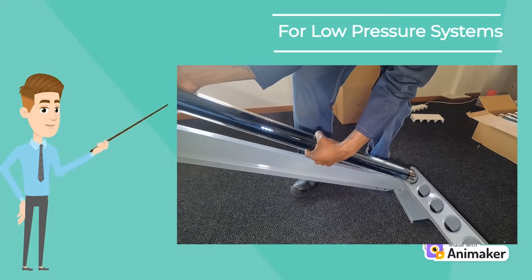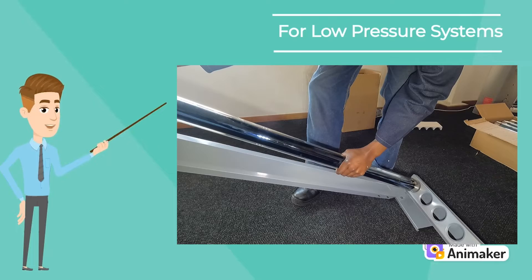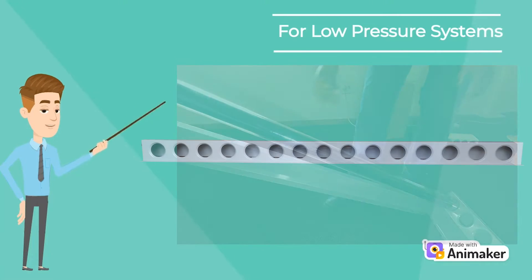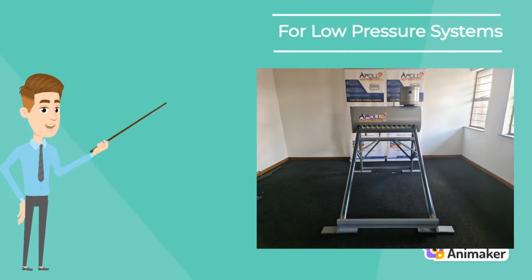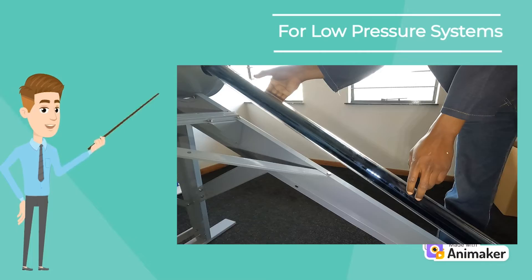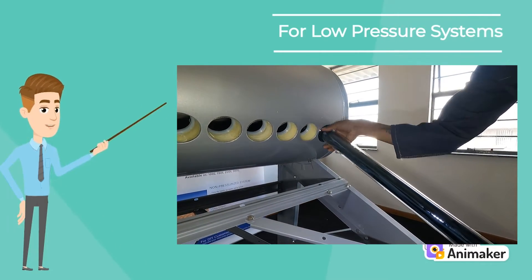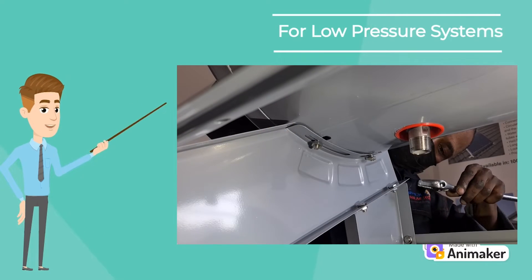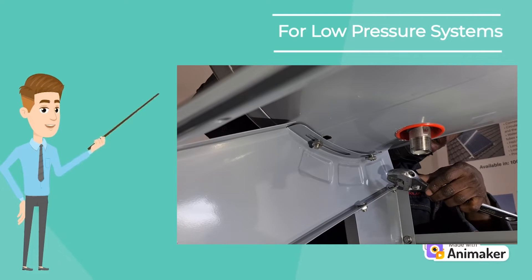Then align the bottom of the tube to the tube holders and gently pull the tube out until the bottom rests comfortably in the holder. Please note that Apollo low pressure systems do not require rubber rings seated in the tube holders. Like the high pressure system, install a tube on either side of the tank to calibrate the angle. The vacuum tube should sit in the center of the opening with equal distances to the edge where the dust rings will slide over and cover. Then tighten the bolt underneath the tank to secure the positioning before continuing to install the rest of the vacuum tubes.